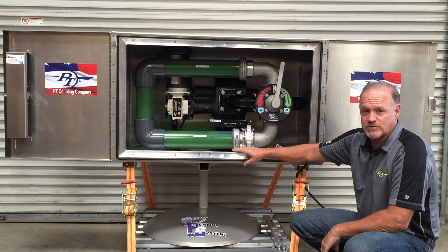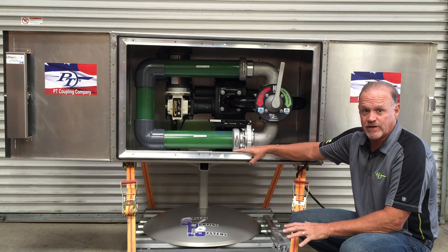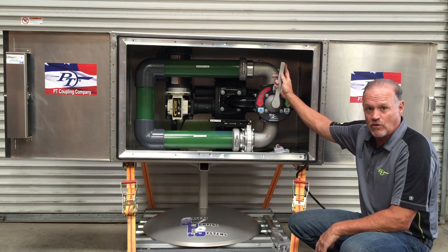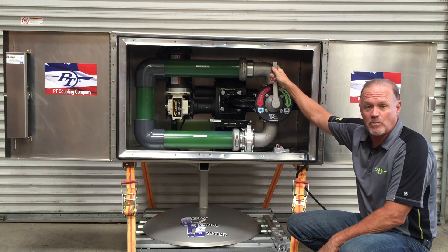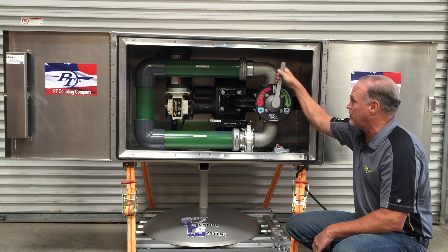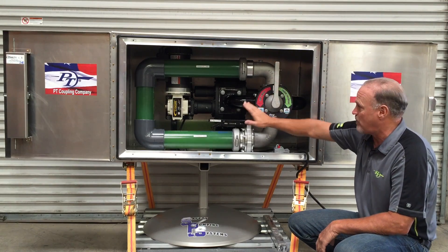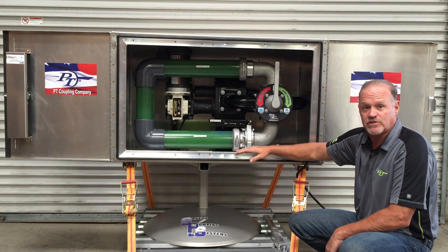Safety Pumping Systems allows a pump to run in one direction and one speed its whole life. Even though you have variable control with a neutral position — no pump, no pressure — to variable unloading the trailer, to a neutral position, back to loading the trailer, all with the use of one handle, while the pump again runs in one speed and one rotation.